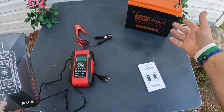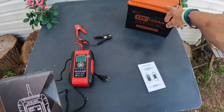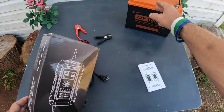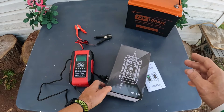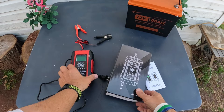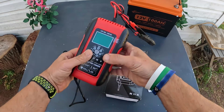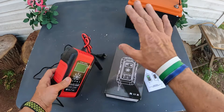If you're like me and you've got several batteries around — whether it's a lead acid battery or a LiFePO4 battery like this — I have this JSD Solar battery, it's a 12 volt 100 amp, and I'm going to be using it for a trolling motor or powering my van to run an inverter. One thing I found out real quickly is that you need a charger that's made for this type of battery.